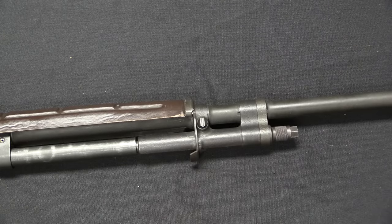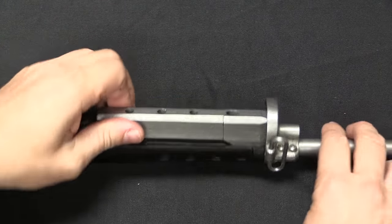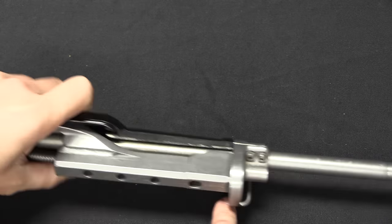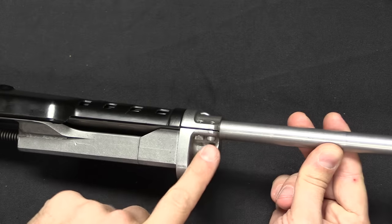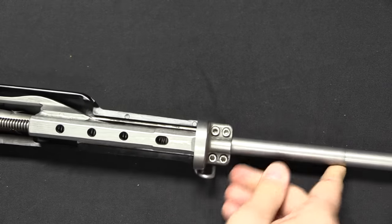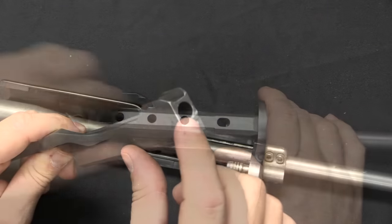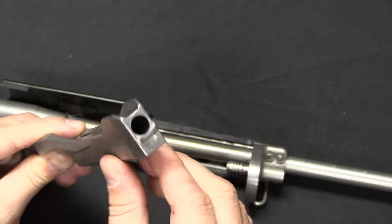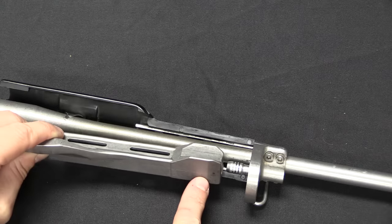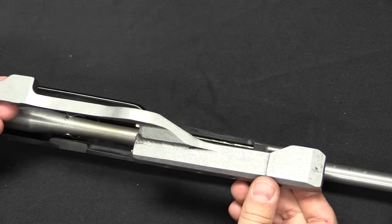This system was really quite a lot of the developmental process, and naturally that's going to be expensive. So Ruger took a look at that and decided: how about instead we just have a little gas vent right here connected to our gas block. And instead of firmly pressing the gas block onto the barrel, we'll just clamp it on there with four hex head screws. Then we'll just vent gas directly into this block of the operating rod. The front end of the Mini-14 operating rod is just a blind hole — gas vents into that, almost like a direct impingement system. There is no moving piston in this gun. Gas vents in there, and then this whole operating rod piece gets pushed backwards. That really simplifies the design of the gun.